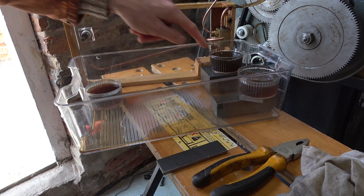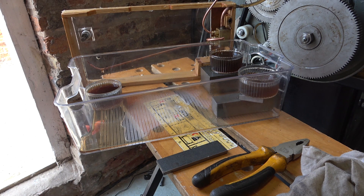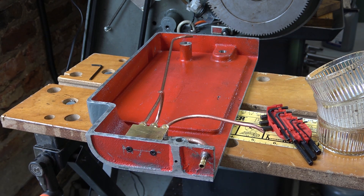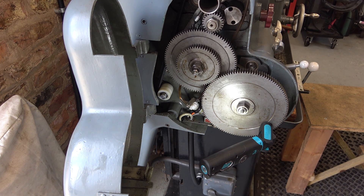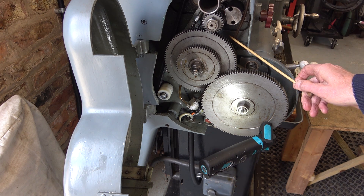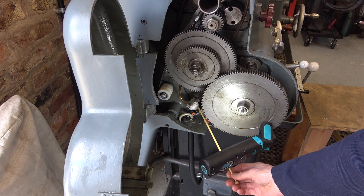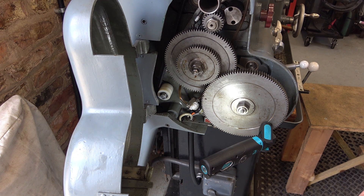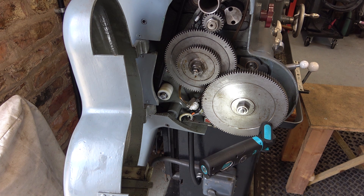These two are about equal; this one's a bit less — this is the back input shaft bearing, I don't think that matters too much. The gear pump is fed by this tube which comes from the back of the gearbox in a copper pipe, and it pumps the oil through this tube here. It's on a timer because it's not continuously rated. It gives a good pressure and a good squirt feed in the gearbox head. But I really wanted something quieter that would run all the time. I looked for a peristaltic pump and eventually found one, so I'll show some basic tests on that in a moment.